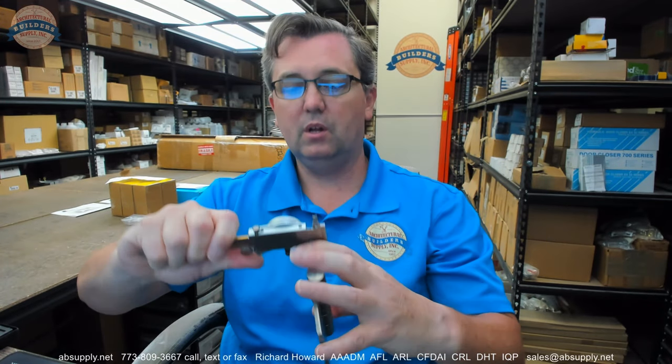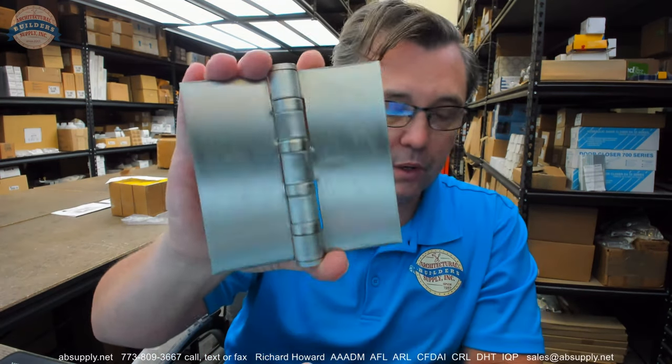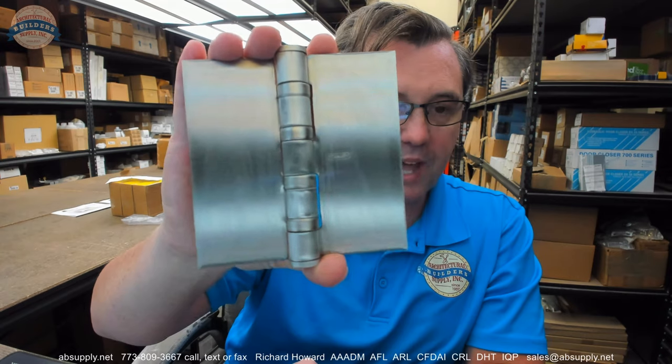It also means it is a heavyweight hinge, which would be nominally 180 thousandths on this hinge. My caliper tells me .173, so a little shy on that. I would expect that to be closer to 177 or 182, but 173 is what my caliper says.